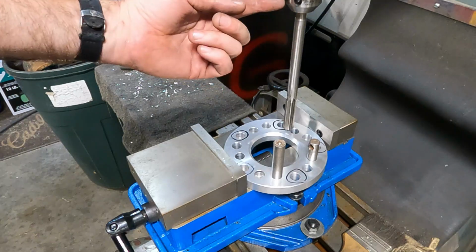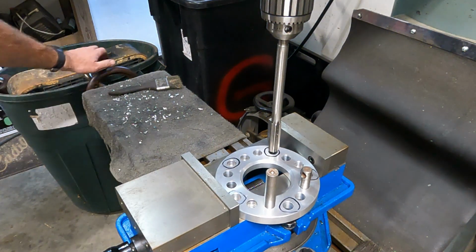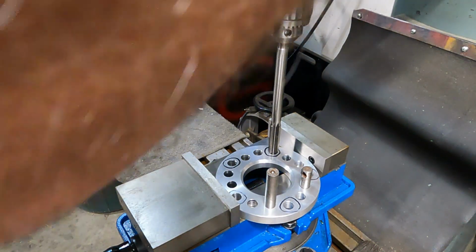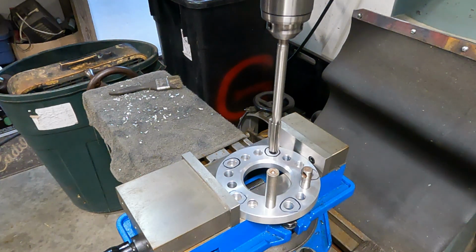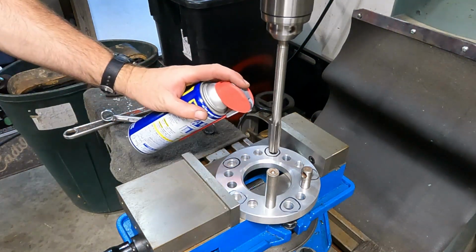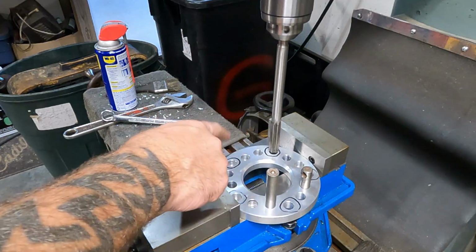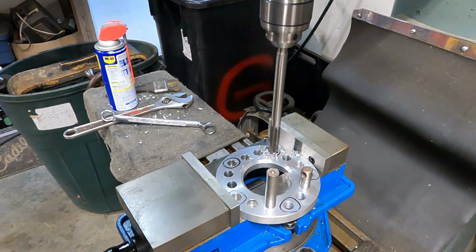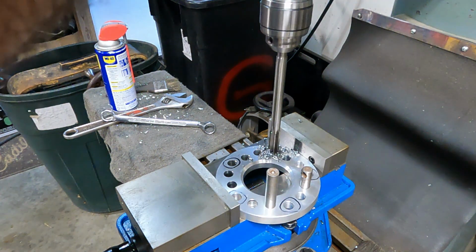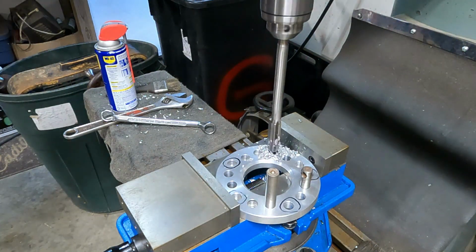First time using this chuck. So now I get this lined up over the top of this hole, and then hopefully every time after this it'll be spot on. Yeah, we're gonna go with that. Speed. Where were we at? Maybe we'll do something like that. This is the 0.64. We still got to go up 40 some thousandths after this one. So let's see how this goes. Holy cow, I cannot believe how smooth that is. That is freaking butter smooth. That's nuts.